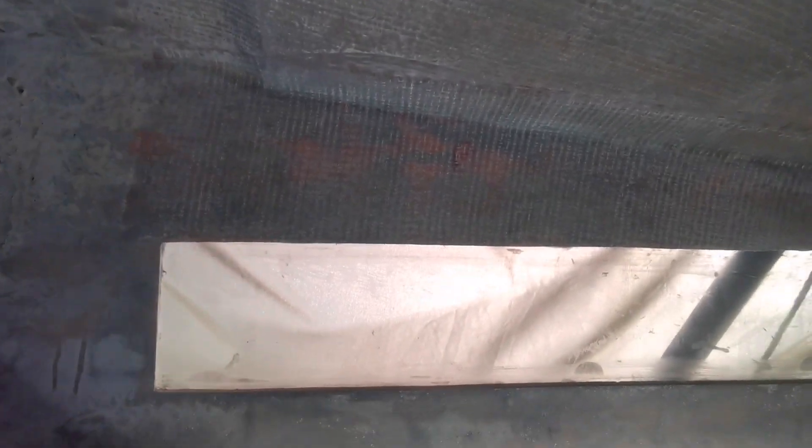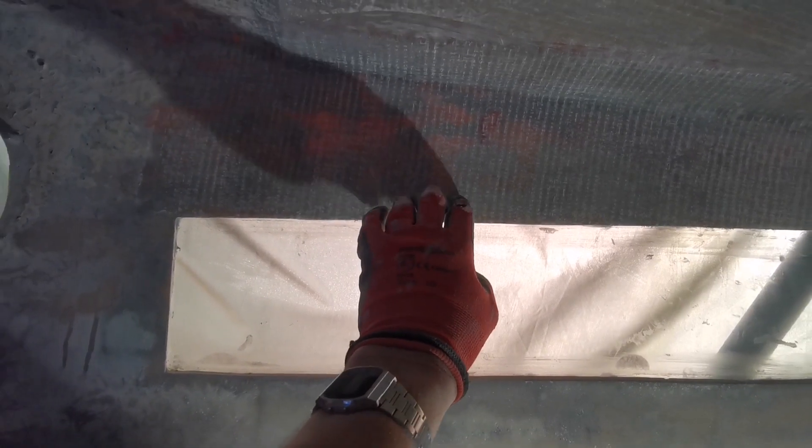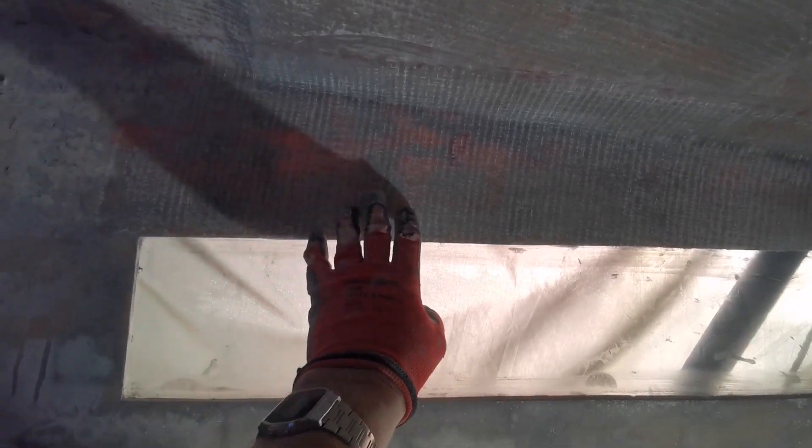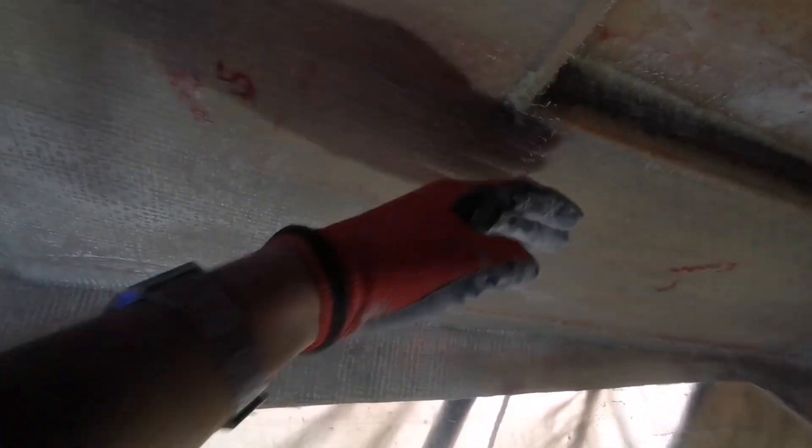This is really heavy cloth — it's seriously thick, CSM backed with a weave on the other side. What I really should have done when I put it up and it was still wet is put a bit of CSM over the top to help finish it off so that it weren't so rough looking. Had I let it tack off and then been able to gel coat it — get a roller and some gel coat on it — I could have sanded that. That would have acted like a filler and lost half of these lines in it.